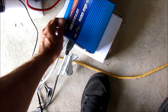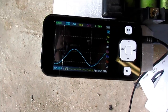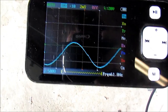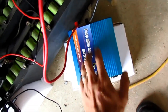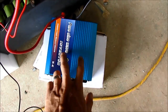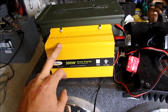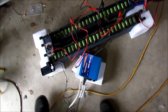I opened it up — it already has a little bit of corrosion on the board because it's not coated from what I could see. Maybe I'll have a teardown video of this later. This is the sine wave coming out of it under max load. With no load you don't get this little distorted part right here at around the zero volt line. But that is a very nice clean sine wave for a cheap pure sine wave inverter. I'm very happy with this product.